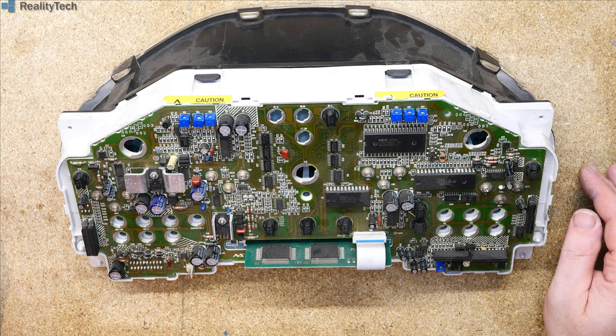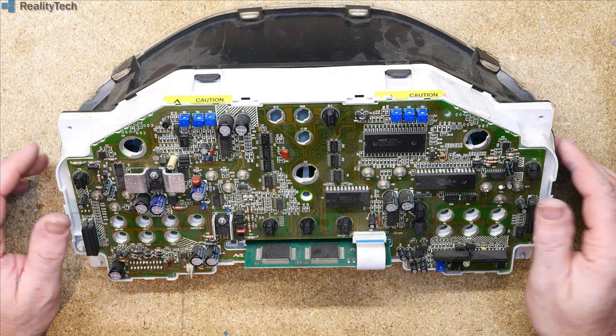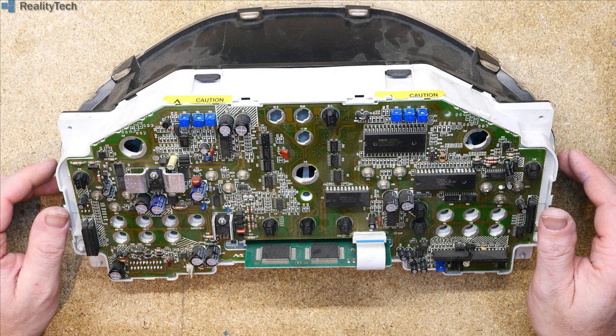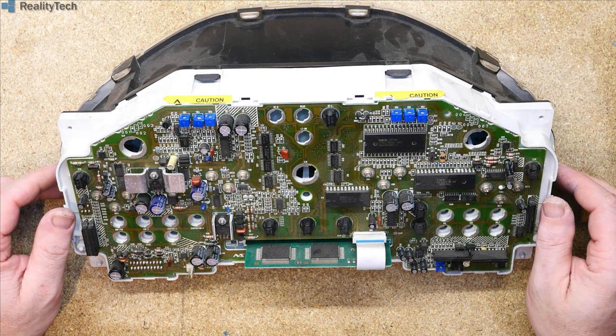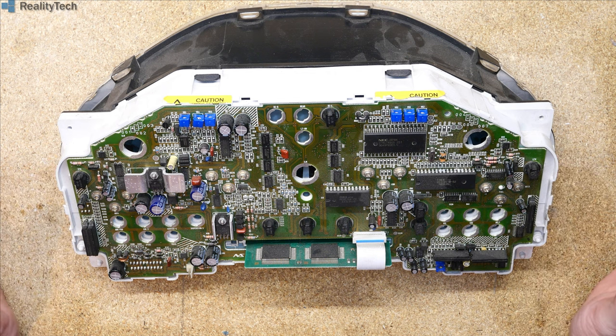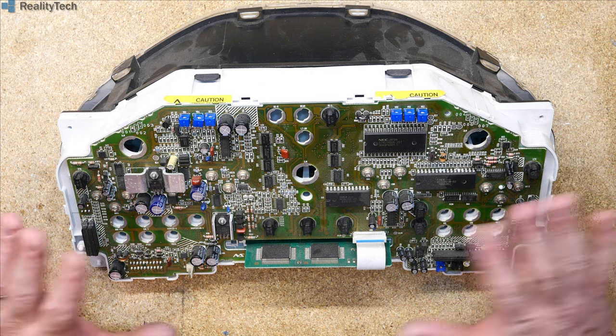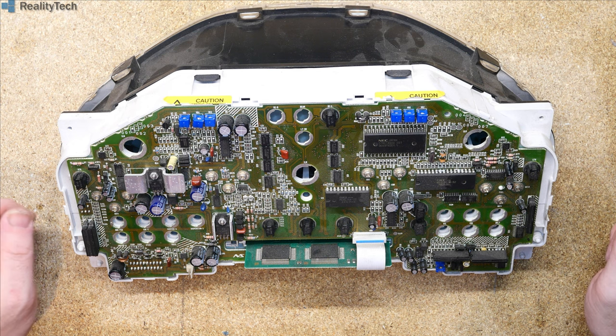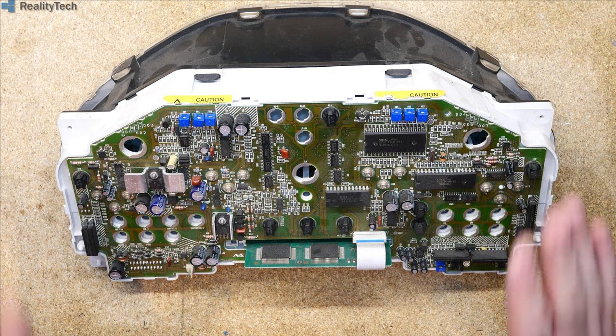That is done completely by the BECM, which is a body control module that is under the driver's seat and the dash. There's the beginnings of a CAN bus type system here, but it's not CAN. The system uses a clock and data line. It is bi-directional and it's used to talk to the door outstations, the dashboard, the engine ECU and other things. As a result, the diagnostics connector on the P38 is a mishmash of quite a few different signals.